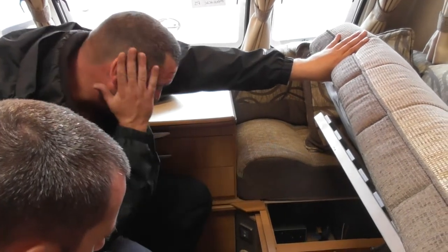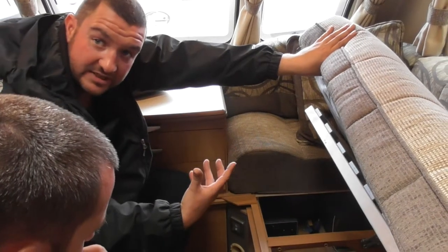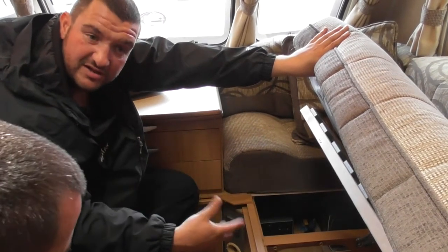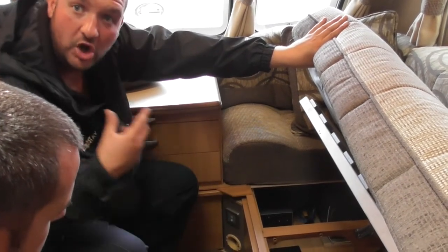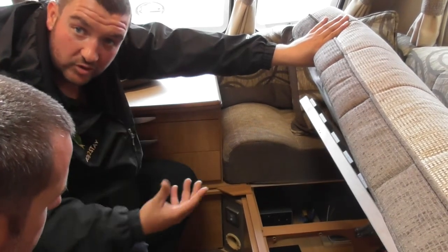So how it works is, once it's got 10 litres in there, it'll heat them 10 litres up. Once you've used them 10 litres of hot water, the water will just run cold. Okay. And then you need to leave it sort of 10, 15 minutes, let it heat back up. And then obviously you'll have another 10 litres of hot water, but it's not a constant supply. It's not like an immersion boiler where you've got a constant supply of hot water. You've only got 10 litres.